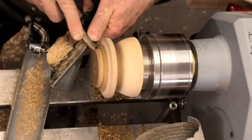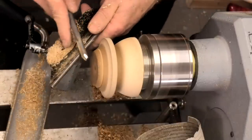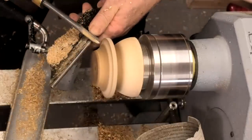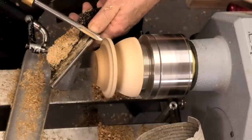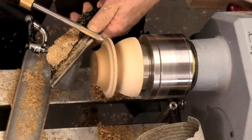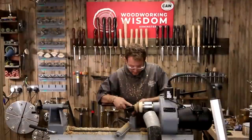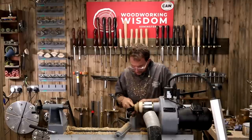Just checking when I'm coming up — up to the bit where it's held, you can see it wavers a bit on here. I've got to make sure I dress it carefully. Working on one curve — thumb, handle's got a lot of movement. My handle goes out wide away from my body, I swing my body weight around and follow that curve. My left foot is on the outside edge of the lathe down near the headstock — that's giving me the access point to spring right in there. Bring that up, come down with care — keep it running. I've got to move left just a little bit, stretching now.